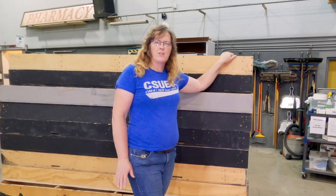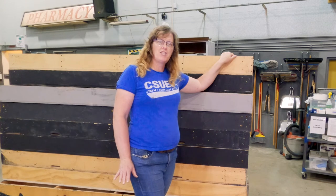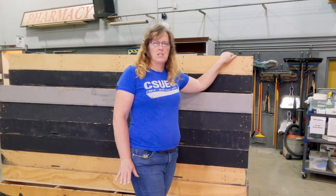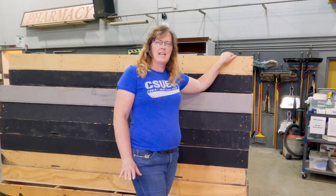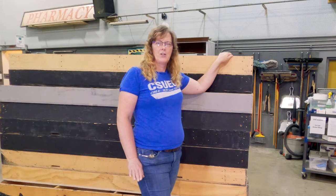I have a stack of platforms here. They're all rejects for one reason or another — not necessarily because of age, but more because of construction style or non-standard stock equipment. One of the things I prefer to do when building platforms is to build all of my platforms with screws and screw everything together, as opposed to using glue and staples.